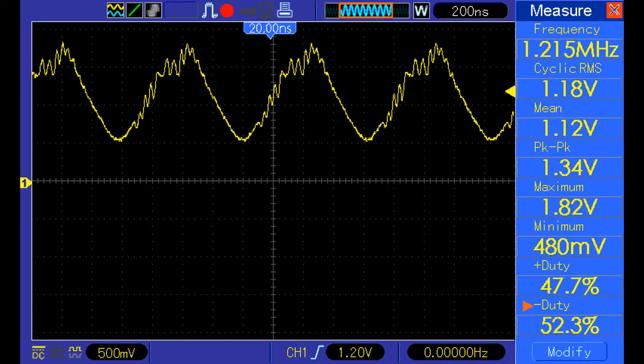Once the circuit is connected and powered up, the oscilloscope probe will measure a waveform across the shunt resistance. This particular waveform is an example at an input voltage of 24 volts and a constant nominal gate voltage of 3.5 volts, held constant throughout the experimentation. I will conduct several trials, measuring the RMS voltage across the shunt to calculate the power flow, and from there empirically build a table showing various conditions and MOSFET parameters to determine what will fail first and at what input voltage.